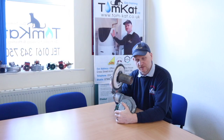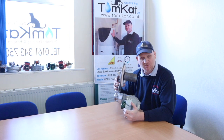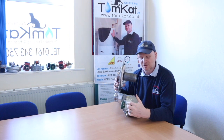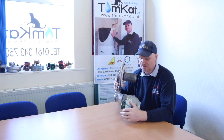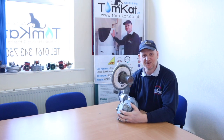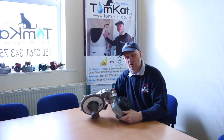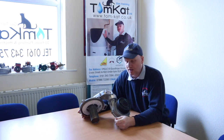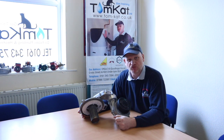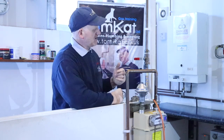So that's a look at the zero governor — remember they're called zero governors because there's zero pressure in there; it's all created from the speed of the fan. Now let's look at what controls a gas meter and an ECV.